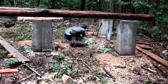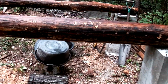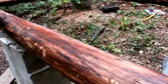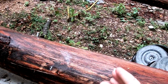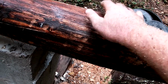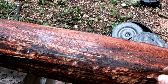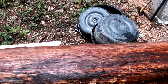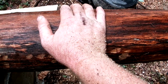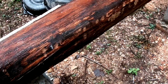When I'm going to put the door of the cabin, like right here, and I'll have some nice stairs going up to it. But I'm going to put the door like right here. So I'm going to need those things for this corner and for like right here to stack the logs. I'm going to V-notch these, just put one of them in. Then the next log will come over the top and it will get a V-notch like this so that they'll stack in there perfect. And I'll probably nail those pieces in there as well. You could probably just use a 4x4, but I'm trying to use as much log as I can. So anyway, I figured I'd just explain that process to you here.